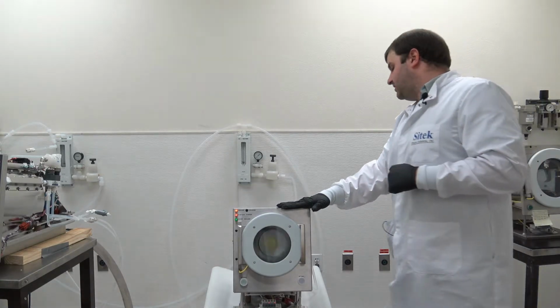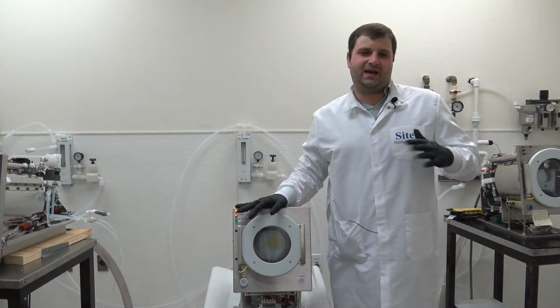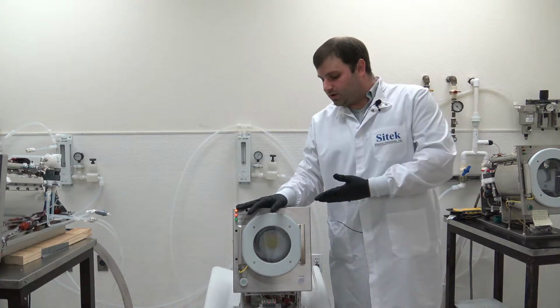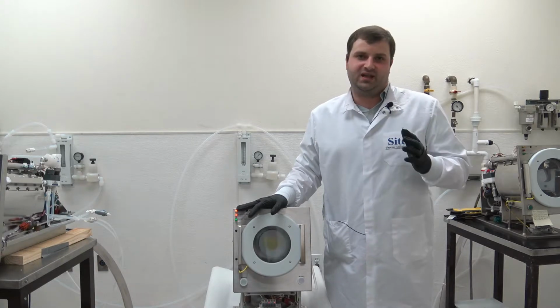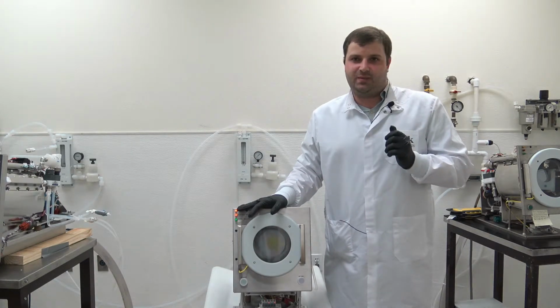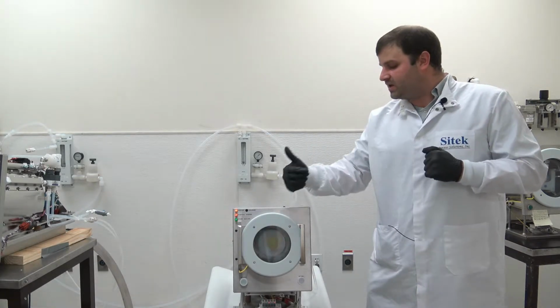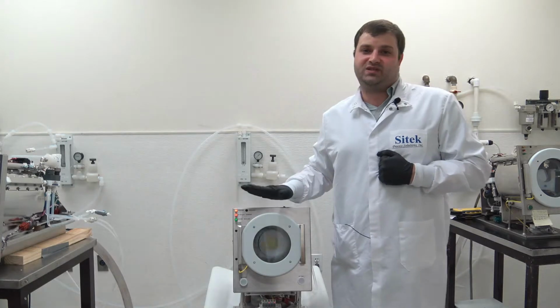Okay, we have about 30 seconds left. When the clock hits zero on the 328 controller, the cycle is not complete. This is older technology, the ST model spin rinser dryers. On the controller, there is a delay. Once the cycle is complete and it hits zero, there will be a delay before the rotor stop positioner fires and this rotor is uprighted into the 12 o'clock position.